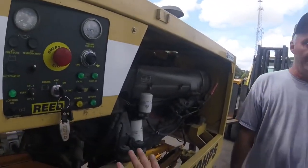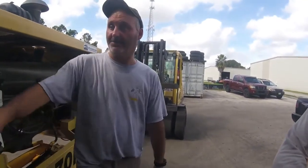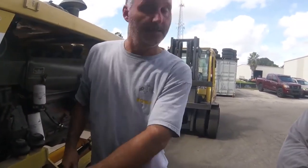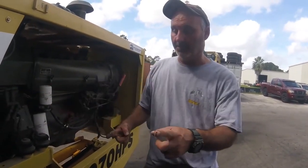To get it ready? That would just be from a mechanic's point of view. Oh, okay, the A and B. I use it a lot to wash the water box out. I don't put it in pump forward. I just hold the cylinder A, wash it out. When it stops at travel, I let go and then hit B. Wash it out, and that's it. A lot of guys just put it on pump and just let it pump real slow.